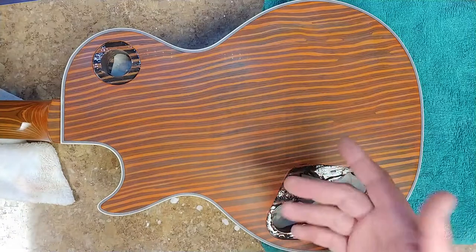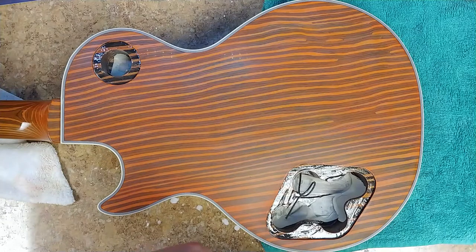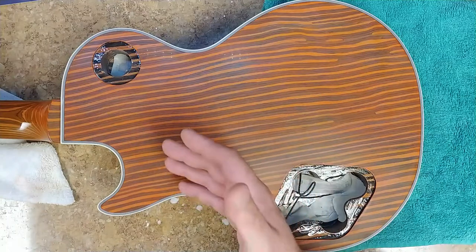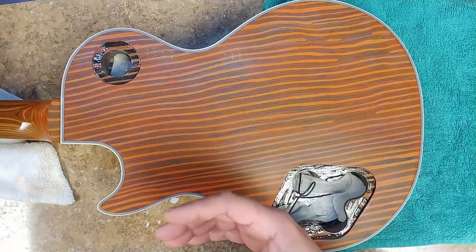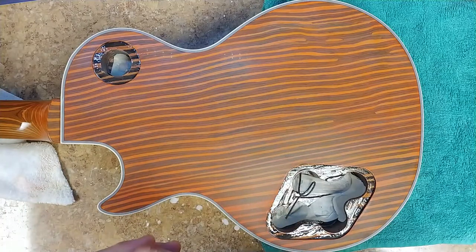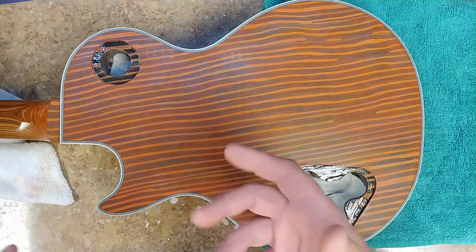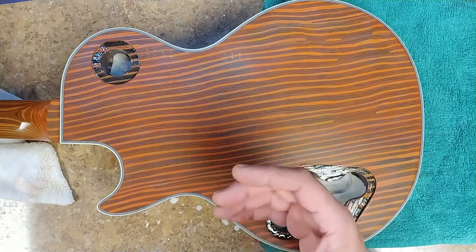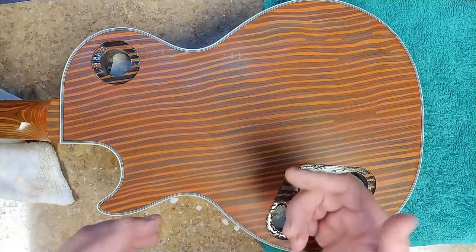I ended up putting a comment on his video, basically telling him to go through the steps. You really want to wow the person who owns that guitar. Go through the steps with the sandpaper and then do the buffing. He basically said that he didn't care. It had some pretty bad scratches in it, and after he buffed it and showed it, I saw some hazy marks in the finish as well. Now, that's not from the scratches, that's from how he was buffing it.